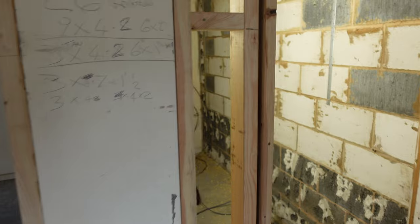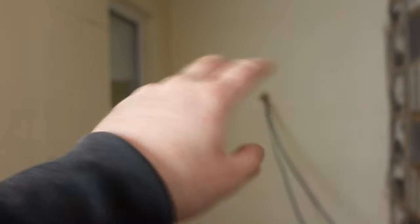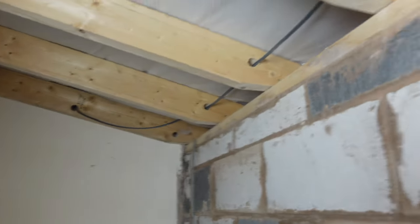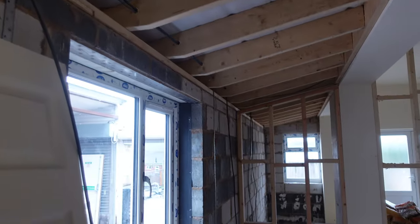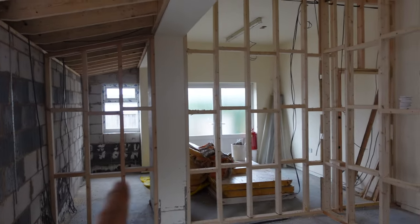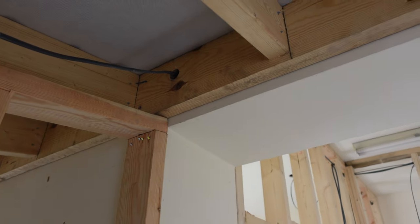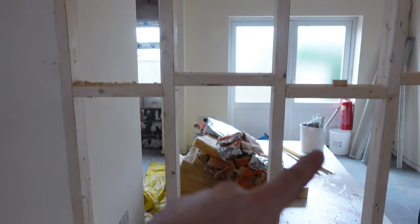In this little cupboard area, our cables come through. This bit overhangs outside the building — that's the corner. There are the immersion cables coming through; I'll put trunking wherever the boiler man wants them. There's the heater cable coming through the ceiling — I'll clip that down the bay and it comes across and drops down next to the window. I've got another one to come off here, dropping down to do a heater in that bedroom, coming across and up through the ceiling on an angle — still in the bay and 150mm off that wall.